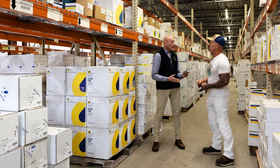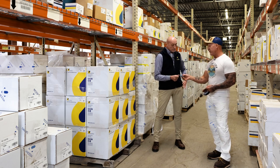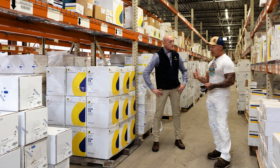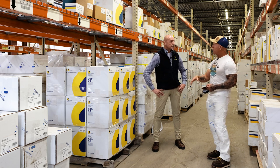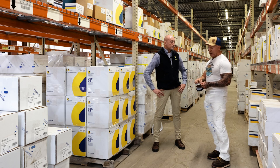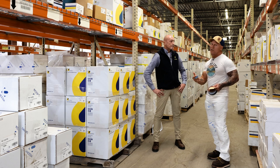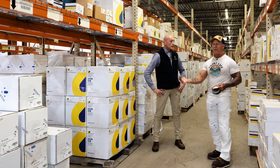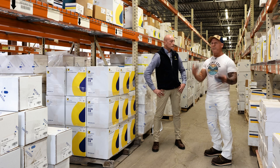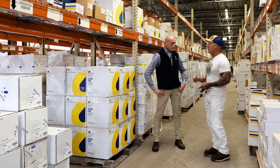Once loaded, it just starts to burn and heat up. For example, if I'm using FilmTech and sanding between coats of 2K poly — if I'm putting too much pressure and not letting the sander do the work and keep it cool — that 2K poly starts to build up in the abrasive. As soon as that starts, your abrasive is no longer effective and you just have to rip it off and use another one. Keeping your abrasive cool and letting your sander do the work makes you less likely to load your abrasives.